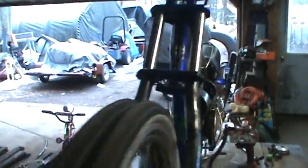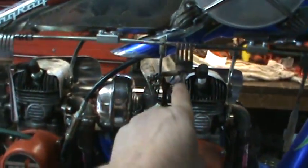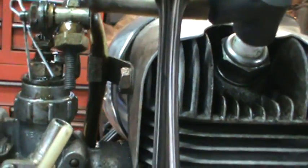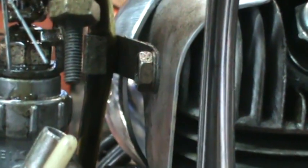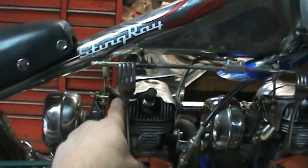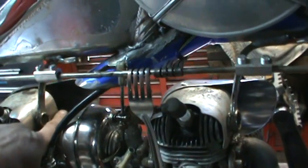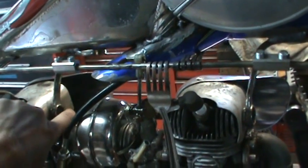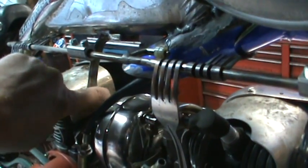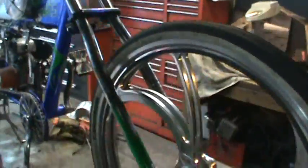Once I take it apart, I'm going to take this piece of aluminum and tap them out so they fill in that gap — see that gap in there? I'll hammer this piece of aluminum out to fill that gap and probably shave off a little of the front here, knock it back about a half inch, three quarters of an inch. Get rid of that material.